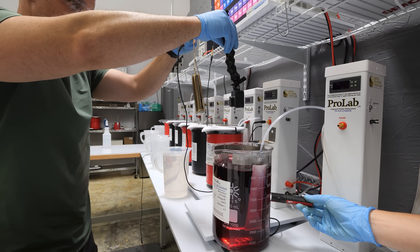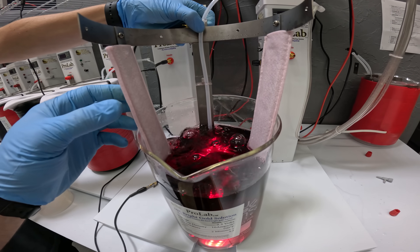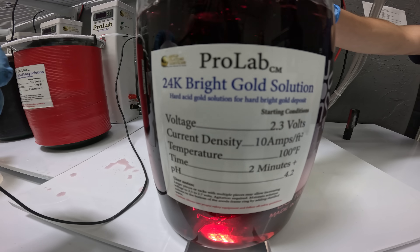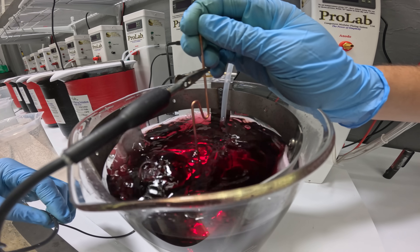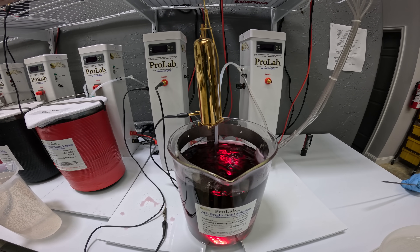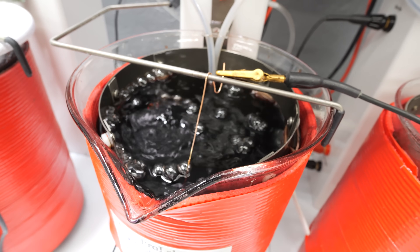The TriVal acid only needs about 20 seconds to do its job. Finally, the LIFEN WAVE comes to our heated royal purple hard gold bath solution, which is heated up to a balmy 100 degrees Fahrenheit. The positive anodes inside the glass beaker are made from graphite. As the current flows from the positive anodes to the negatively charged toothbrush resting on a titanium bus bar, the gold ions in the solution are pushed with 2.3 volts and 1.395 amps towards the toothbrush and collect on the surface. The current continuously funnels the dissolved gold ions from the liquid solution to the toothbrush, where they attach — microscopic gold ions clicking together just like little Legos to stack the gold thicker and thicker the longer it's left in the solution.